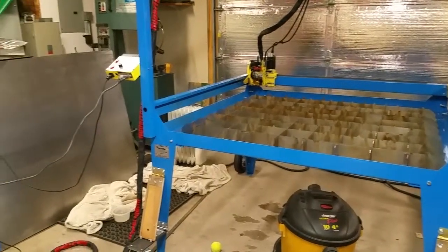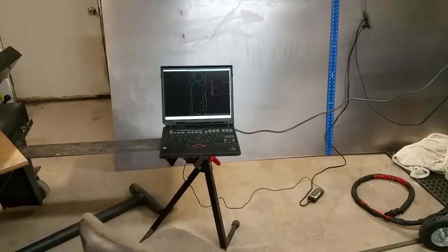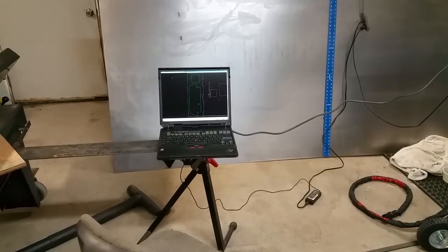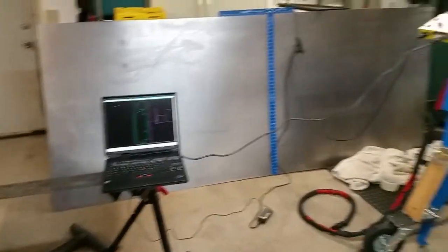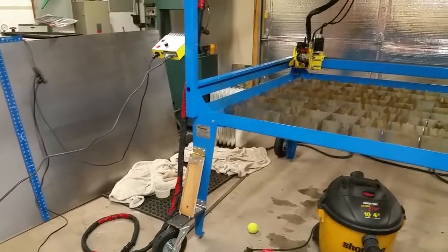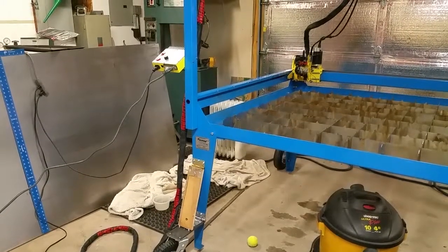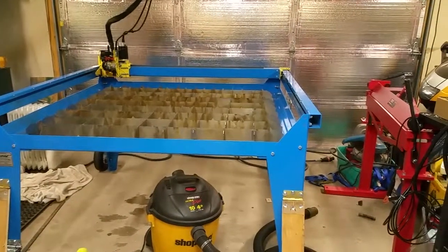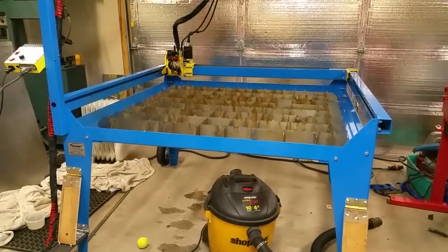I don't think I'm going to get a machine torch right away. Believe it or not, the only machine I had that would be able to run this is a laptop that's about 14 years old — a 1.2 gigahertz Pentium 3 IBM laptop with a parallel port. While running Windows 2000 and only being a 1.2 gigahertz machine, it runs this table just fine. I can do the full thousand inches a minute and it seems to control everything just fine.